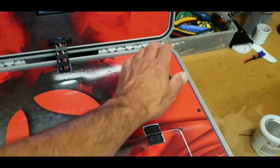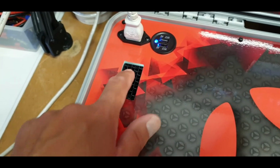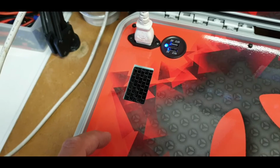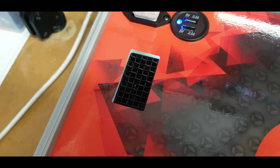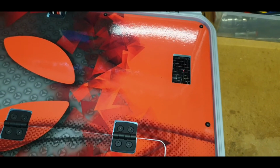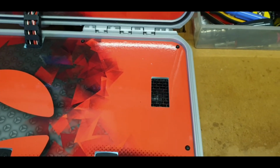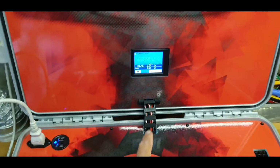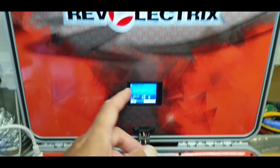Everything else is the same. We've got the radial cooling fans as normal, and this was obviously me going back to my first designs, where I would trim, spray paint, and then mount a piece of stainless steel mesh in there, which does look good. But now, as you've seen in my later videos, I've gone to cutting the air slots in there, which I think is perhaps a little bit better, or from my perspective it definitely takes away a little bit of labour time, which is good. Obviously, cable chain again as normal on this one, taking the cables into the lid. Bump controller is essentially hidden.